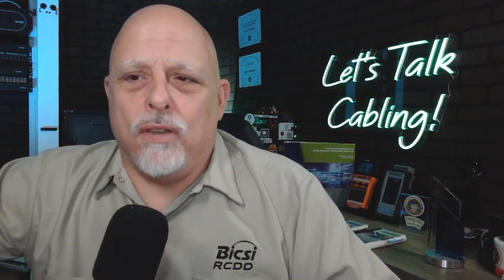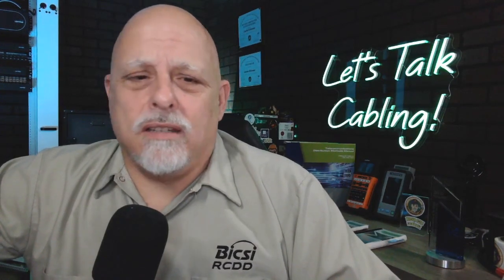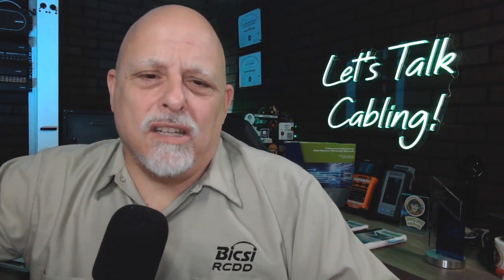So you're talking about fusion splicing, arcing and electricity. What kind of safety precautions does a technician need to take when doing a fusion splice? Well, the arcing usually takes place in a closed environment. So we have a wind cover that covers the fusion area during that process. So there's no effect or possible harm to the technician while that's fusing, because you can only imagine how much heat that's generating within that area. And it's also for just a split second. It's a very, very short period of time where that arc is occurring to make that fusion.